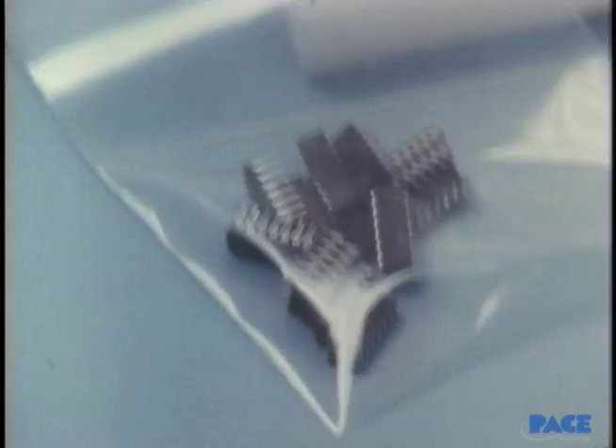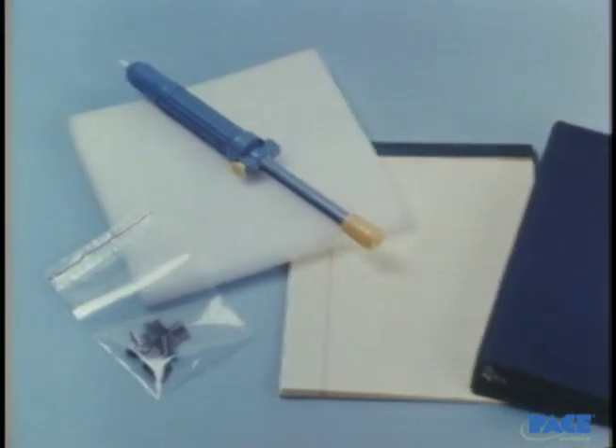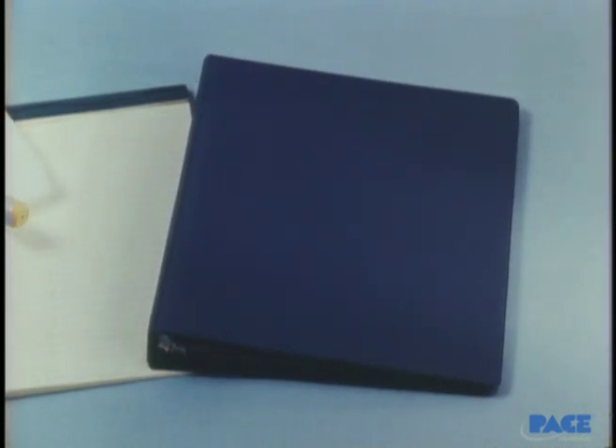Virtually all plastics, unless they've been specially treated, are static generators. This includes the plastic bags often used for shipping and handling conventional ICs, plastic foam and solder suckers, paper, plastic notebooks, and polyester clothing. They all can generate the charges. But since they are non-conductors, you rarely get a destructive discharge directly from them. What happens is that they induce a charge at a lower level on a nearby conductor. And sweaty human skin is one of the most important ones for us. We've all been zapped after our shoes have brushed across a carpet and then we touch a metal doorknob. Replace the doorknob with the metal of a PC board and the board gets zapped the same way.